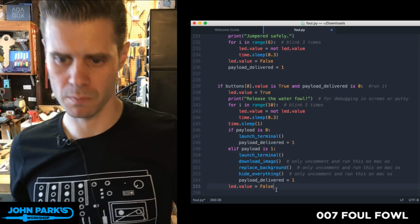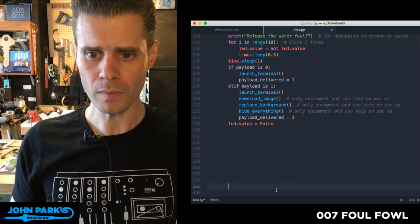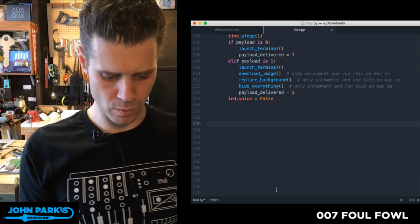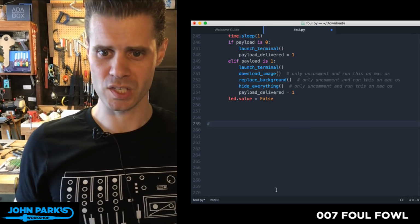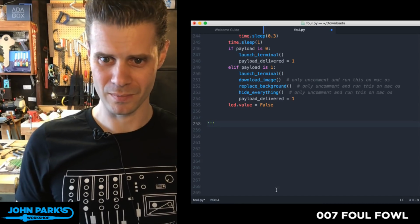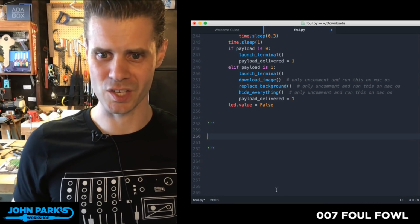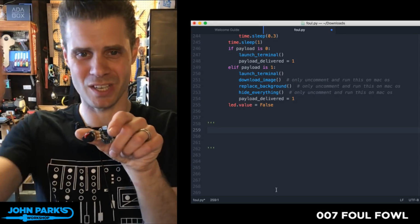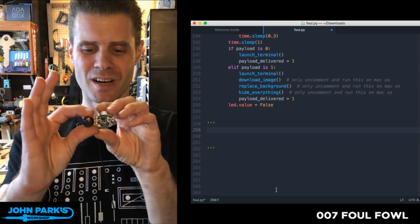And I'll just clear some space down here at the bottom. Kattni was helping me with some of this, and as we were testing these things, we both realized you need a little safe spot down at the bottom of your code. You could put a little comment out block like this. That's where you leave your cursor when you plug these things in, because it may just start typing, which can screw up your code if you forget and leave your cursor somewhere.